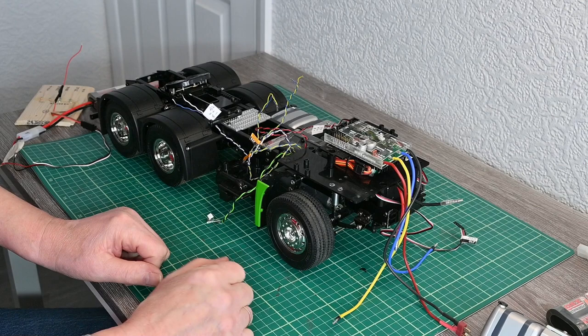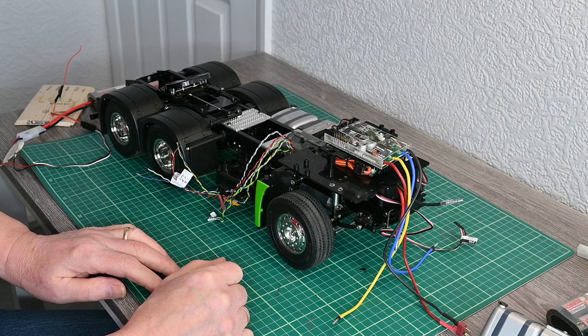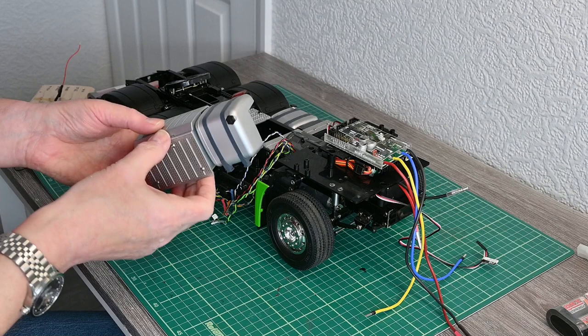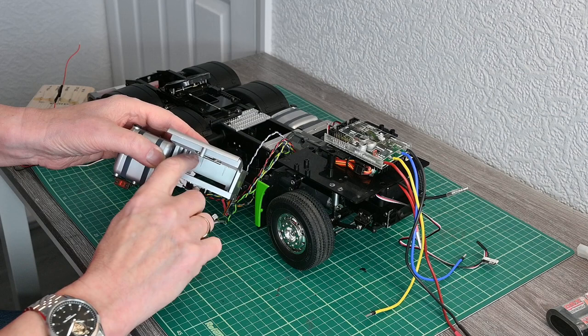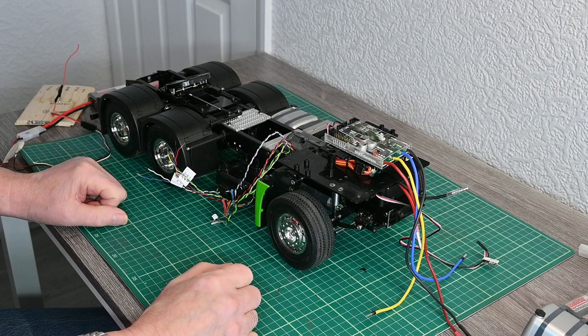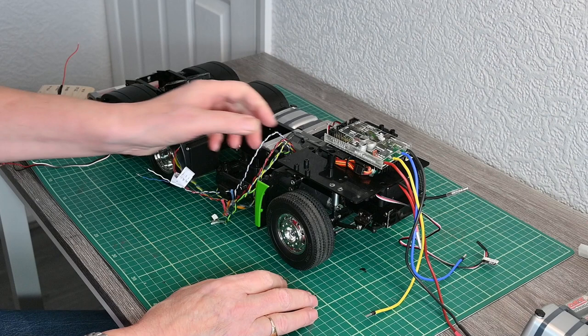I normally use electrical strip connectors for those to get a nice solid connection between the two. That pair there are your positive and negative and I use an adapter to the Tamiya-type plug. I've got the wires here from the rear coming out the side — we've got steering servo and shift servo. This box will have a little panel and I'll drill a hole for the standby switch and another hole for the USB port so we can communicate with it by plugging the cable into the computer.